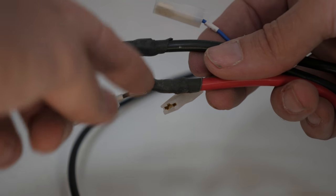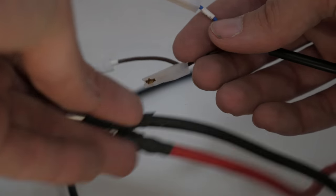All there's left to do now is to hook these up. This is 12 volts and this is from the control box. The connections are labeled clearly on the compressor right behind the quick couplings. I turned on the power and the fridge is running — and I haven't turned it on and it's still in the off position. So the good news is that the evaporator is cold, so the system is working. It might just be the control box that's messed up. So I've just spent the last 45 minutes going over everything, checking everything, just trying to find a fault.